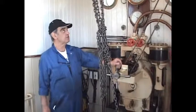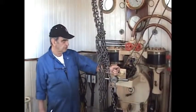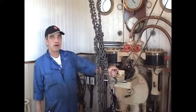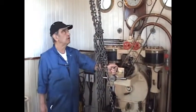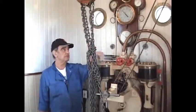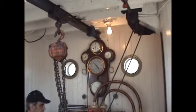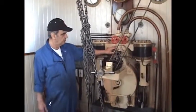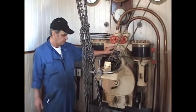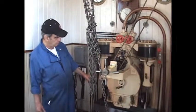This is the steering engine, steam powered, as was the practice in North America. When the captain turns the ship's wheel, all he is actually doing is rotating a shaft which drives this valve and moves it one way or the other, and which way it moves decides which way the engine is going to turn.